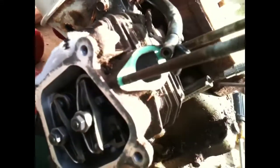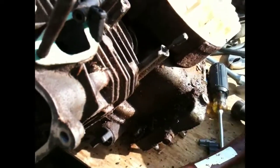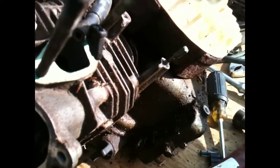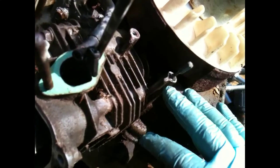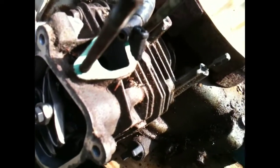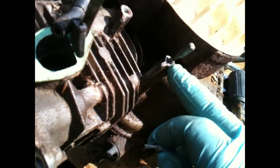I had a little bit of stub there — I tried with vice grips to get it but I couldn't. So I soaked it with WD-40, heated it up real good, and then after heating it I gave it a good crack right on top. I'm using a Torx bit that's just a little bit bigger than the hole that I drilled.